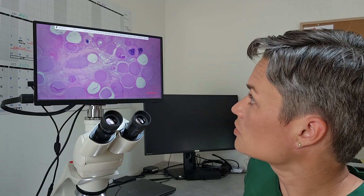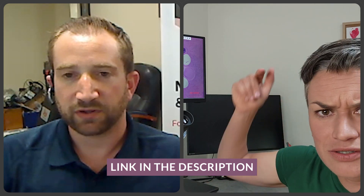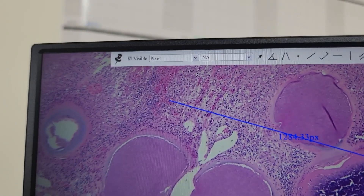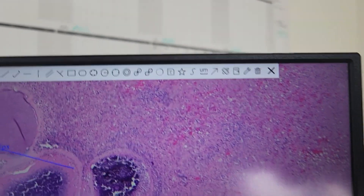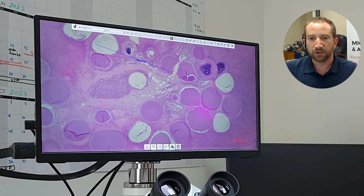In the live view, or in a captured image, you can annotate. We want to make sure your microscope is calibrated ahead of time — we have videos to guide you through that. Once it's calibrated, select the magnification you're using so it's accurate. You get a large selection of measurements: standard distance line, parallel line tools, circles, radiuses, angles. You can even do an area tool to figure out the area of a cell. You can change the color, size, thickness, and font — all easily adjusted.